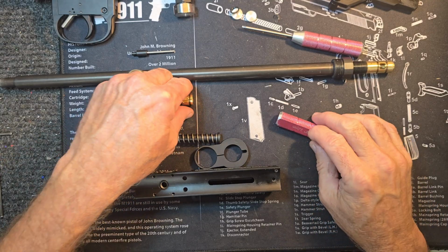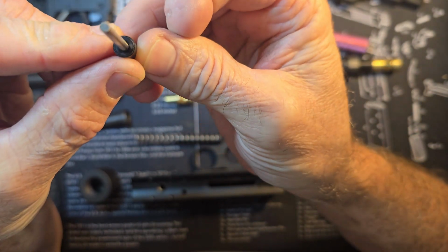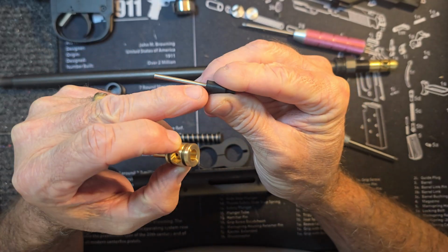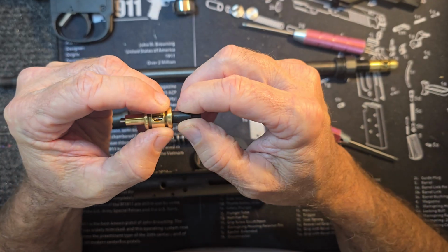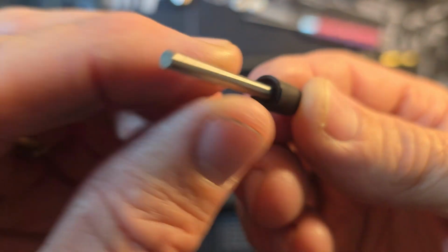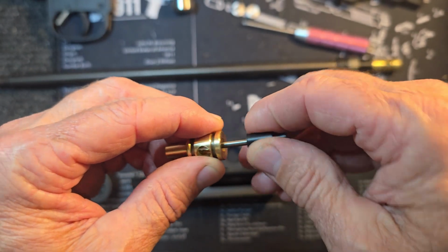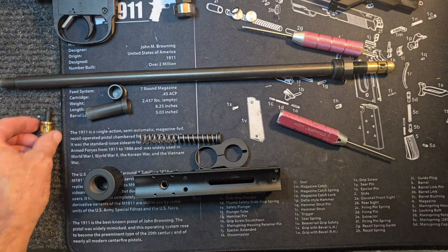All right, so now one of the other problems I've ran into when taking it apart is this poppet valve. It is actually being extruded in. I hope I can keep this on camera, but this poppet is being extruded into the valve itself. Let's see if I can get a really good close-up of it for you. But see how it's got a lip there on it? Shouldn't have that. That means it's falling down inside of this hole, and that makes it have to have more force to open it up, and that's not good.